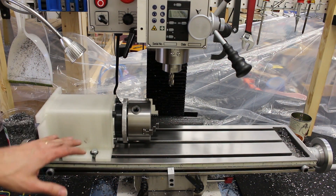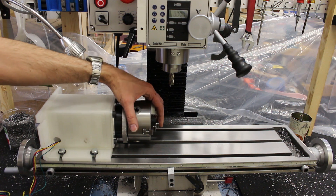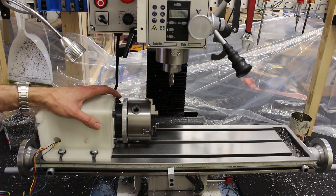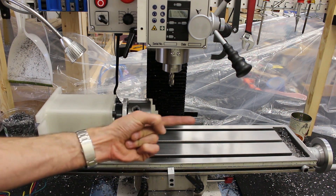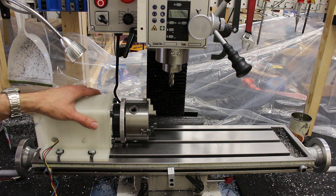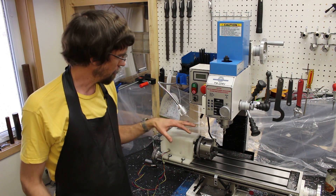Here you can see how the unit will fit on the milling machine — it fits quite nicely with bolts on both sides in the T-slot and sits quite low to the table. The trade-off is it limits how far I can open the chuck jaws without hitting the table, so for a part larger than about an inch to an inch and a quarter in diameter I'd need a spacer to raise the fourth axis up. I'd rather keep it low for rigidity since most things I'll be milling will have a fairly small shaft in the chuck. I can face it pointing either left or right, but I prefer left and will run the cable out that side. I hope you enjoyed part one of my harmonic drive fourth axis project — stay tuned for part two where I'll finish the assembly and put it to work.